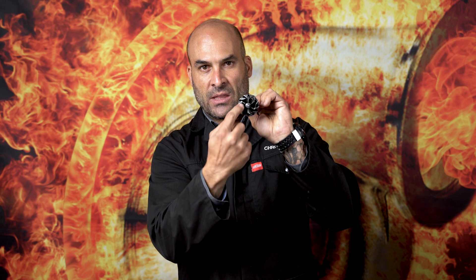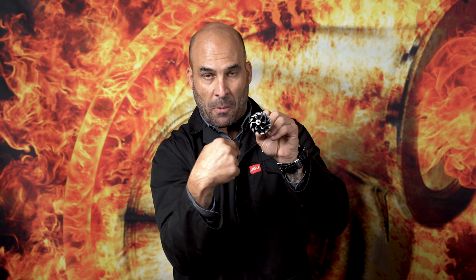However, in abnormal operation — excessive operating conditions — let's say this compressor wheel is turning clockwise and comes to a sudden stop. Recap: normal operation looking at the compressor is clockwise; tighten the shaft nut anticlockwise; loosen it clockwise. If it's turning clockwise and comes to a sudden stop, it's going to spin and unscrew the shaft nut. In an exceptional operating condition, the shaft nut can loosen. Sometimes it loosens during a bearing seizure and the rotating assembly becomes loose again after seizure. Other times the seizure is so severe it spits the shaft nut completely off, and as the rotating assembly begins to turn again, it sucks the shaft nut back in and damages the leading edge of the blades.